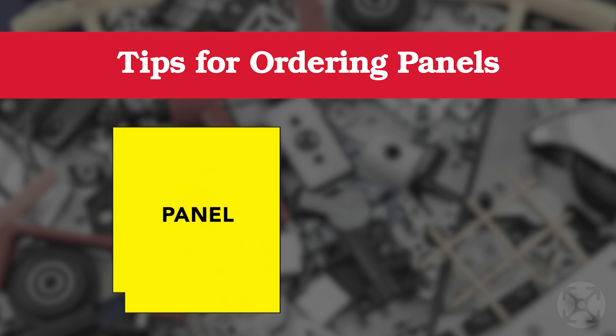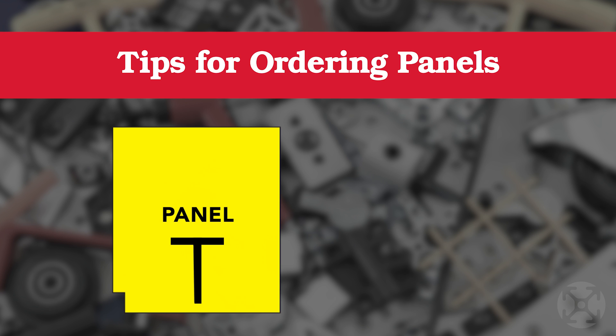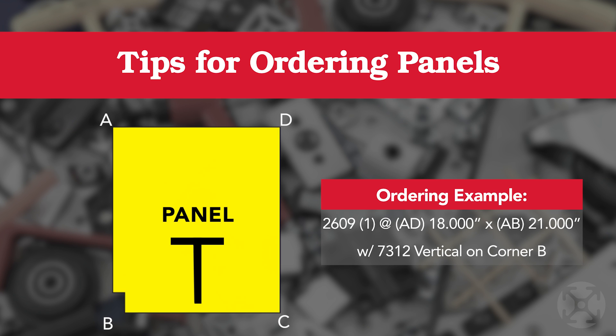Panels like ABS hair cell have a smooth side as well as a textured side. The outward side of the panel must be specified with a labeled texture. Another item to include in your panel drawing is a machining reference. Label your panel in a standard format, beginning at the top left corner in a counterclockwise order, and reference the call outs when ordering machining on your panel.